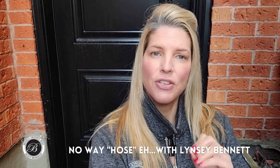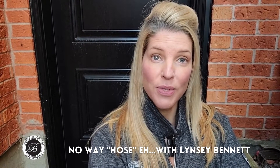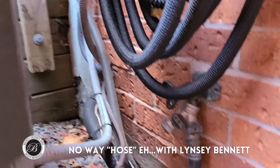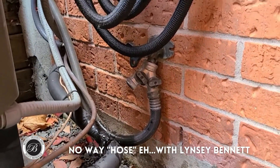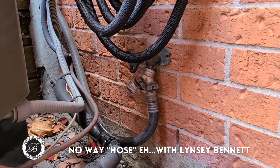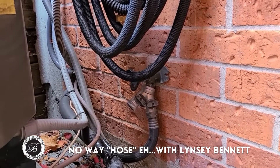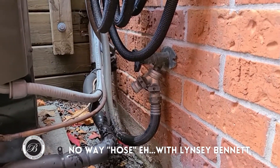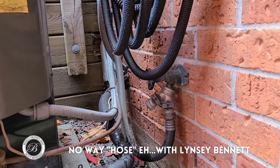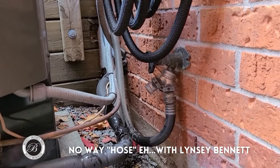So I already went ahead and turned off the tap from the inside of my home. Now, what we need to do for the outside — let me show you. So here is my exterior hose bib. I have already turned the water off from the inside of the home. And many people forget this part. They turn it off on the outside and kind of forget about it. But in case you don't have the proper type of faucet, you want to prevent any freezing and any potential opportunities for the pipes to burst. So now that the water is turned off on the inside, you want to make sure that you clear the pipes on the outside of any water.